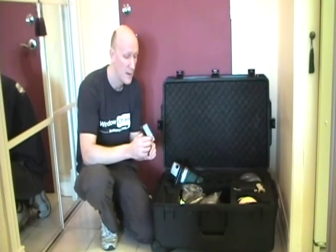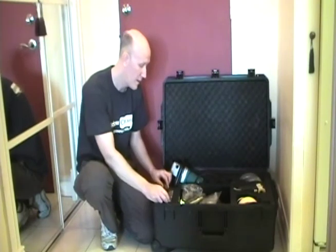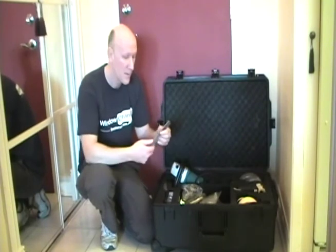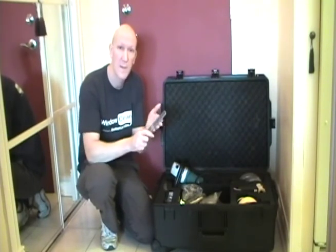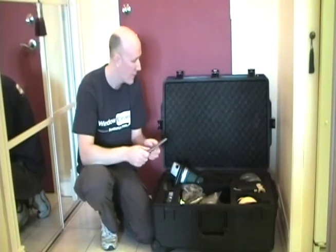You've got your stiff wire brush here, and that's for tapping on the pads to get glass stock off. You don't actually brush it, you tap vigorously on there. We'll be taking a look at all this too down the line. You've got your rasp tool, which is used for roughing up your polishing pad. Every once in a while you want to roughen that polishing pad up, because it's going to get gummy with the polish and everything.